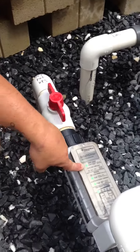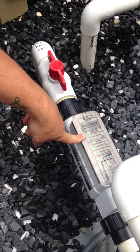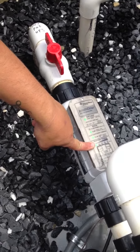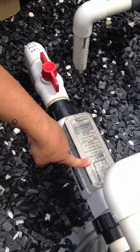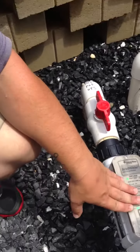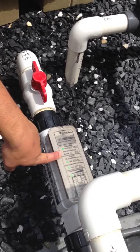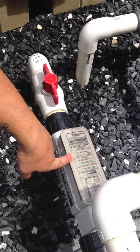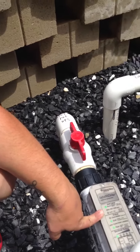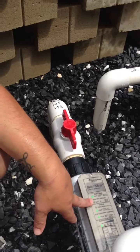Our salt levels are where we're good now. So we have the proper amount of salt in the pool to create your sanitizer, which will allow you to keep the water in check and in balance. In a nutshell, this is where your sanitizer is produced. If you notice the red light comes on, you may want to add salt to the pool — there are test kits for that. A simple rule of thumb would be to add a bag of salt and look for the green light.